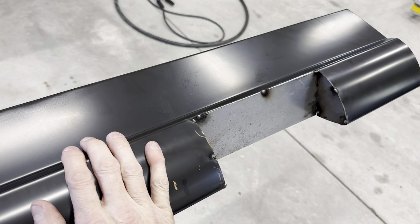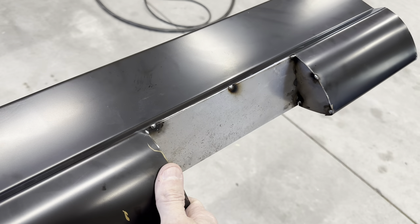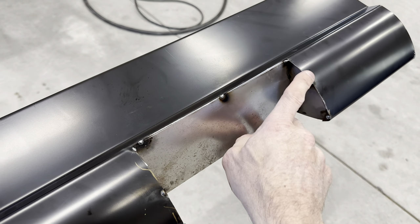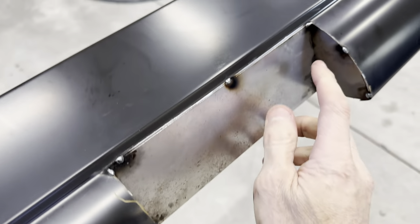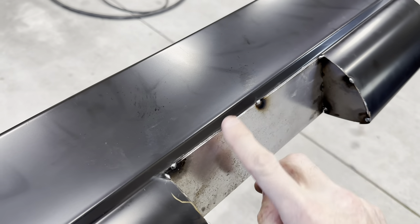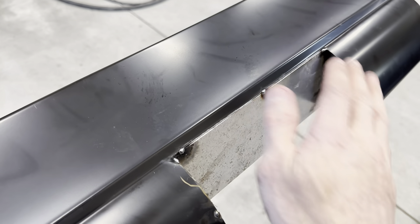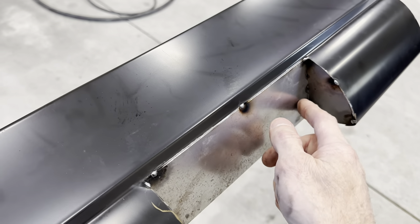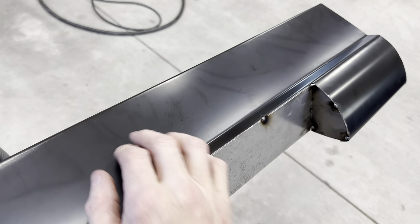Got the roll pan off — I may have dropped it, but that's another story. I'm going to explain my welding approach: I'll weld along the outer edges, but on the insides I'll weld from the back side. That makes it much easier to grind and finish — if I weld the front seams it's harder to keep it flat. Welding from the back side lets me grind and round it over while keeping it dimensionally stable — nice radius edges on three sides but a sharp 90-degree edge so the tips still fit well.